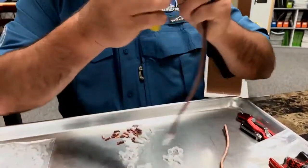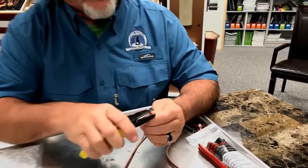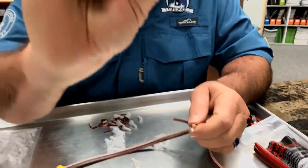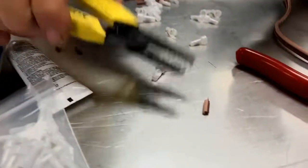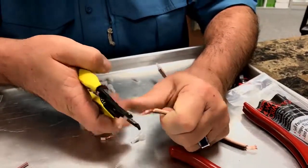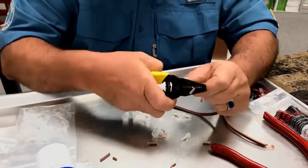One of the things you want to do is proper stripping. We all know strippers are liars, so you've got to be careful. If I go to the 18-gauge and strip it like it says, do you see how there are shavings of wire in there? I've probably cut four or five different strands. You never want to do what the stripper tells you — you've got to go up a size. So I'll go up two or three sizes, put it over, pull up, and rip the wire. You can almost hear it — I rip the insulation off. I don't cut into the integrity of the wire.